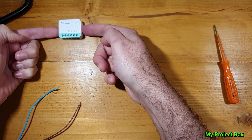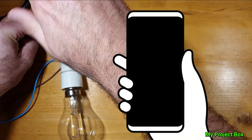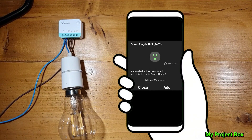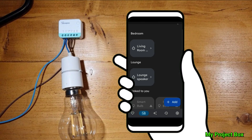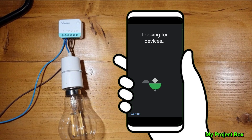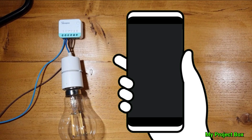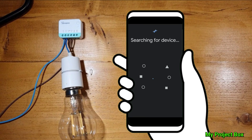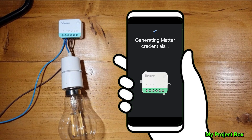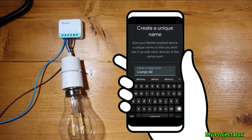Let's start by giving it a live and neutral supply, then connect a light bulb as a load so we can set it up on Google Home. Samsung SmartThings picked it up straightaway as a Matter device, but I proceeded to go with Google Home instead. Adding it to Google Home was straightforward — I just had to add a new device, scan the QR code when prompted, and it quickly added it. It even popped up a picture of the device in a pretty blue-green teal color, and before you knew it we had Matter control.